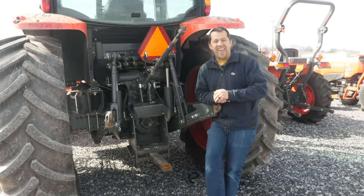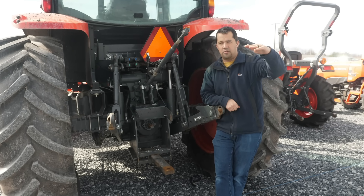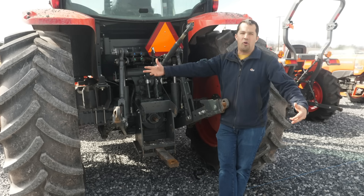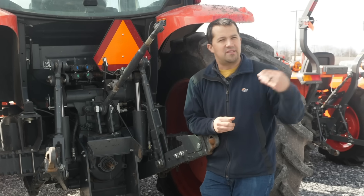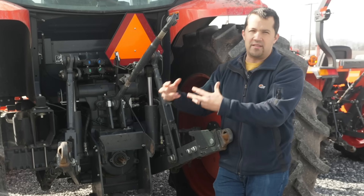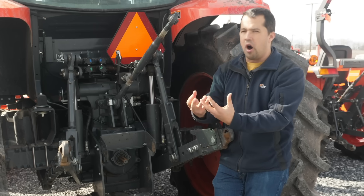Bigger machines also occasionally have a function called ePTO or economy PTO. That puts a gear selector in line with the PTO mechanism, allowing you to run your tractor at lower engine RPMs but still get the required 1,000 or 540 RPMs for your implement. That's useful for applications where you have a 200 horsepower tractor but only need 100 horsepower going to your Batwing mower, letting you run the engine at lower RPMs and potentially save fuel. However, modern Tier 4 engines with electronic fuel injection burn fuel based on torque load and not just engine RPMs, so in my opinion that feature today is almost unnecessary and not really the best scenario for your modern engine.